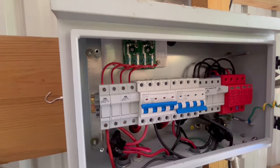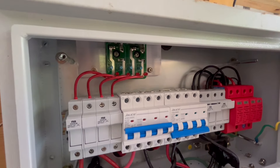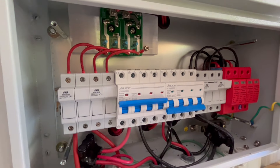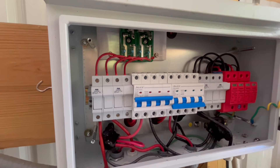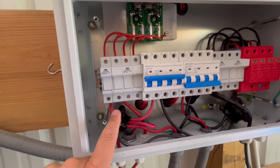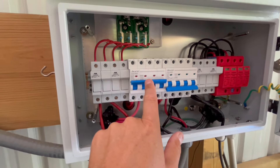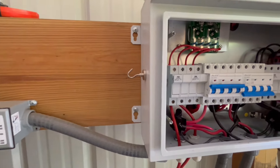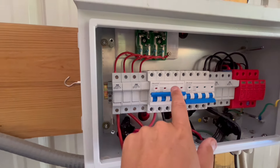First I want to show you the EMP shield here — the light is off of it, and that actually went out two or three months ago. They said I can send it back and they'll swap it out, but I never did because it was functioning anyway. When you open up the combiner box, I can see there are no indicator lights on the array. This one on the left — PV1 — that went out a while back, but this one should be on and there is no light. I checked all these fuses for continuity and they're good. I actually had one of those blow earlier in the season. There's been a lot of lightning this summer. I have two strings of 10 running into this combiner box — A and B. I'm not using B. I've got A here and this is the output to the inverter, and that's where I put the EMP shield. Before it goes to the inverter, it passes through the EMP shield. That's what I think the issue is because this should be on. I have voltage to the array itself, but once you get through this breaker, I've got nothing.